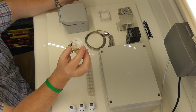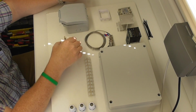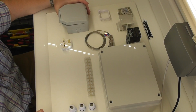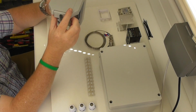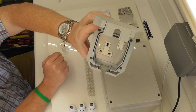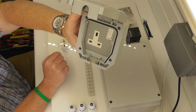Said it's only a sort of 2.7 kilowatt element, and it's a Burco. It's on a plug top now, so I'm going to be going a bit heavier duty on the cable just to keep the heat down best I can. And then I have got a weatherproof socket. Sorry about this, shit camera handles. So yeah, weatherproof socket.